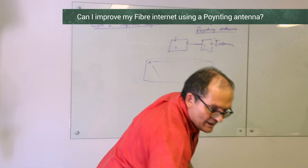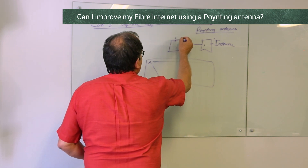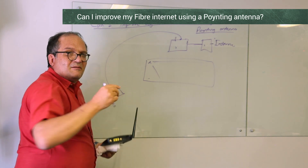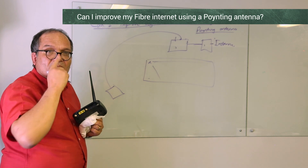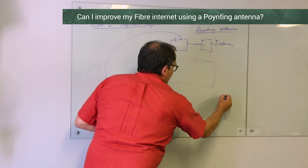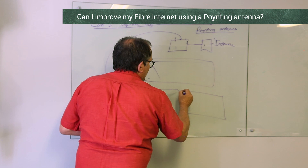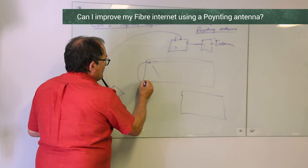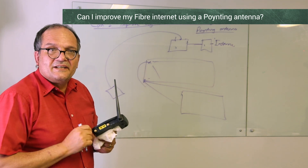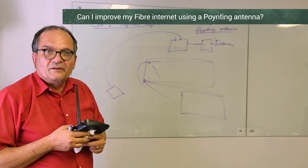The other way is that this router provides Ethernet ports, so you can run an Ethernet cable to another location and put a second router there. This addresses indoor or outdoor coverage — for example, in a factory with an open area where people work, you can place another router and put an antenna on it that beams in a specific direction. There are lots of ways to improve your speed, because the weakest link is often the Wi-Fi connection, and better antennas improve that.